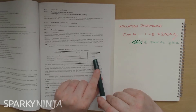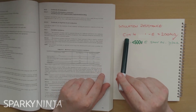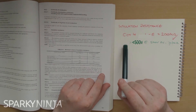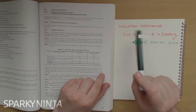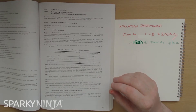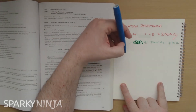So the value of one megaohm is only acceptable for the board of this circuit when I've combined all of the other values for the other circuits on this board. For all I know, there could be another circuit on this board that, when combined with this resistance in parallel, results in an overall insulation resistance coming out lower than one megaohm.